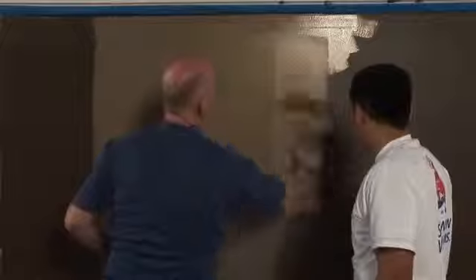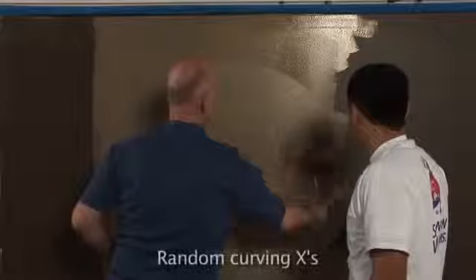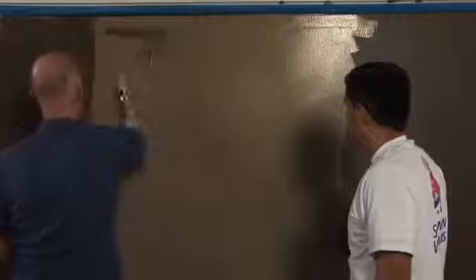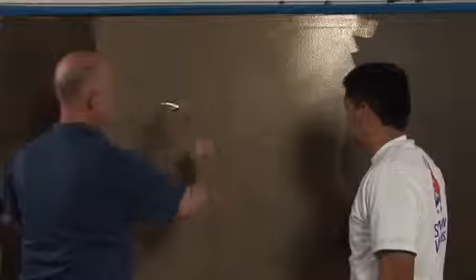You can apply it straight up and down, blend it in, and then start doing the random roll again. It's that random curving motion, random curving Xs. You're basically using this microfiber 9/16ths roller to drive the mica — the metal particles — in random directions. And then as it dries, it flows and levels and creates a mottled, nearly sprayed appearance.